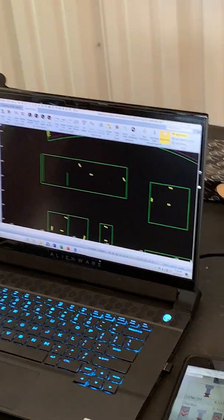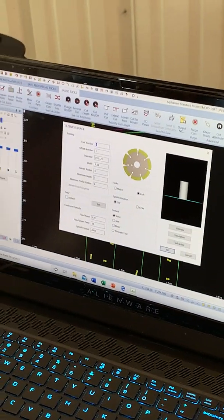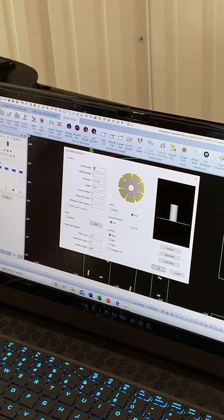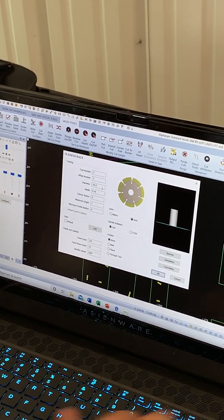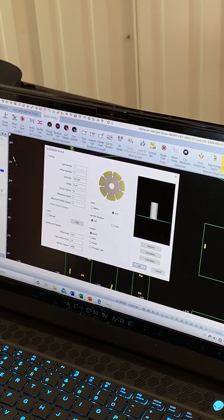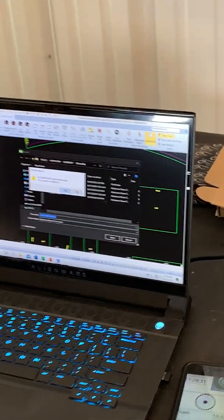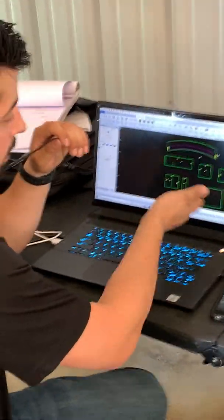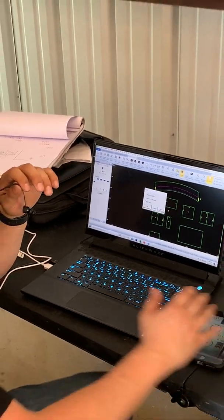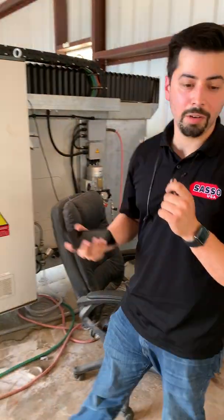Your finger bit has been updated. For the blade it's a bit simpler — click Select Tool again, right-click on your blade, go to Edit Tool. Enter your blade diameter — we had 19.146 — click OK and Save, confirm yes. That's how you update your tools in AlphaCam. If you already had tool paths and cut lines, you'll want to purge your cuts and then run Cut Parts right after. That's how you touch off your tools and update them in AlphaCam. Thanks for watching, have a good day!